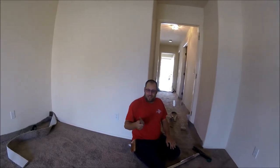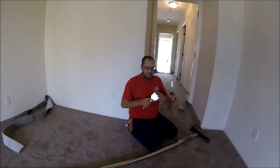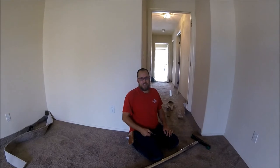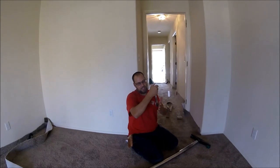It's easier than the plastic ones or the little knives or hook bills some people use. This has got some weight and meat to it, and it's nice and rounded on the edges, not sharp and pointy. Jerry's is newer so his is kind of pointy, but he uses it the same way. We don't have issues chopping up the baseboard. The key thing is we don't bring our packer off of the base — we constantly just slide it up and down. That's the key to not damaging the baseboards: just don't remove it whenever you're tucking. Maybe that'll help somebody.